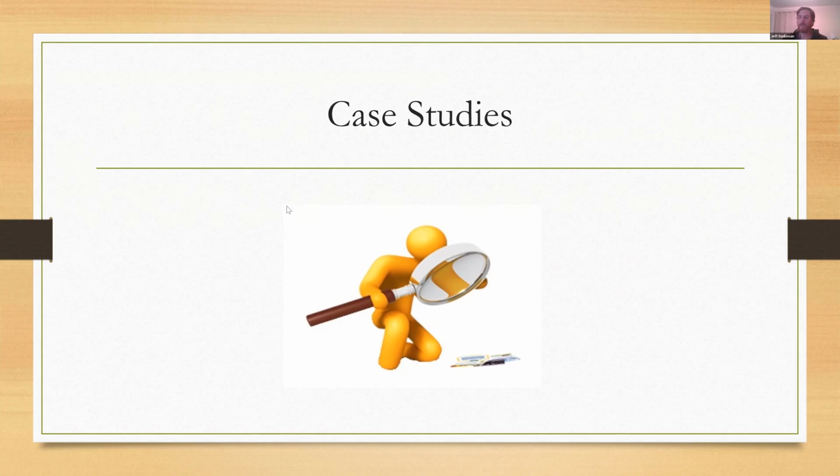All right, so thank you, Kay. To kind of go off her part of the discussion, my two case studies are both projects for single-family residential infill construction projects here in Brookhaven, Georgia, and the focus on root bridging, or really, I feel like the more appropriate term for my two case studies is floating concrete sidewalks and driveways. So the focus is going to be a little bit more on minimizing impact and protecting tree roots, critical root zones for permanent developmental requirements.